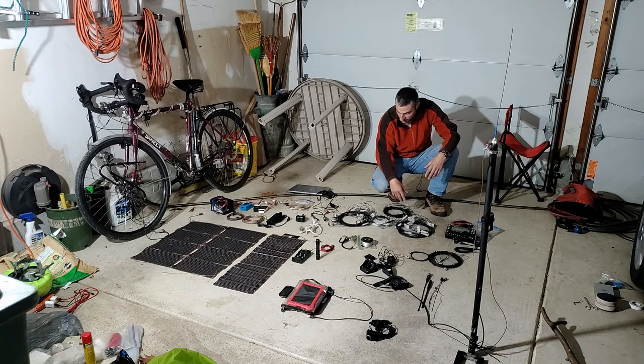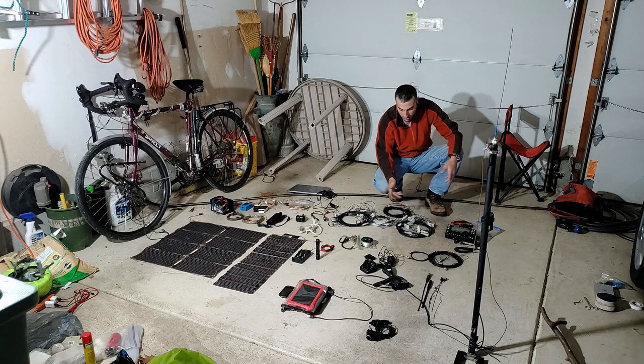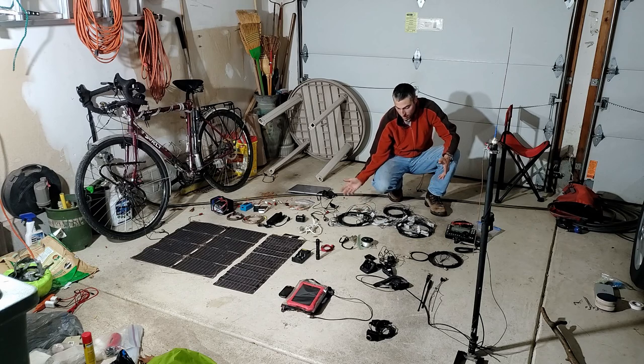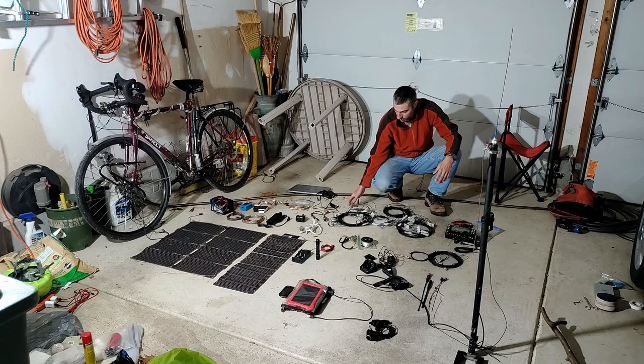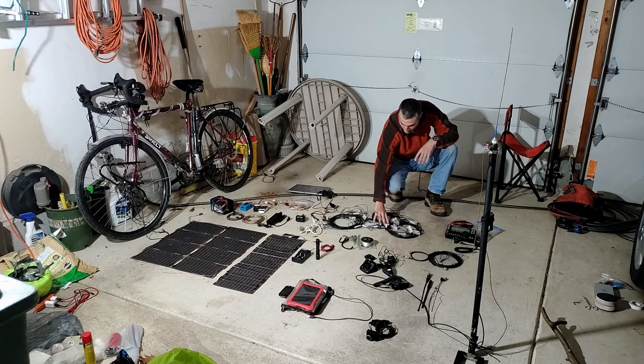It is a complicated antenna build just because it has so many bands and you have to be very careful with how you tune it on each band. But once you go through and do all the effort to put it together, you've got all the bands in it, no tuning required. If you want to change bands, you just drop the feed point a little bit, get to the jumpers and connect up and disconnect whichever ones you need. Then you pull it back up and you're on the air. So for a camping antenna or portable, it's absolutely fantastic. So we've got that one.